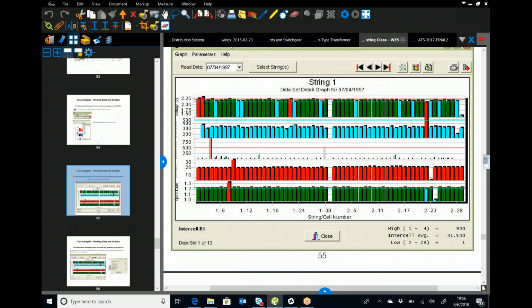The big difference with the Albert versus the Midtronics, the Biddle Bite, and most of the other handheld type battery testers is that the Albert is actually putting a load on the battery and looking at internal resistance. You can look at multiple white papers from IEEE. Albert has a lot of them. They always go to BatCon, and obviously they're presenting their product as the best one.